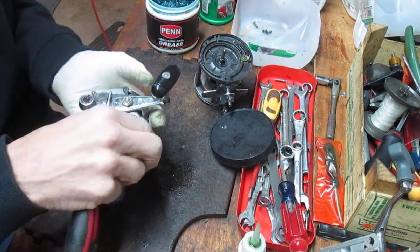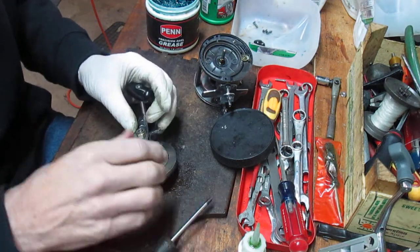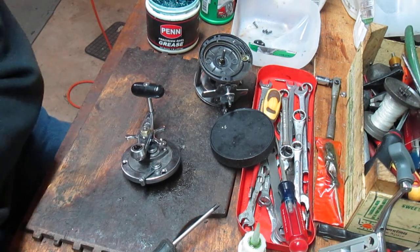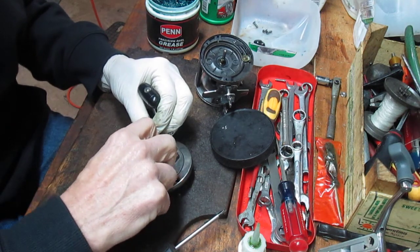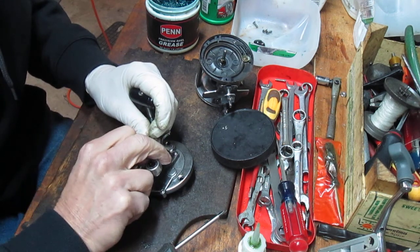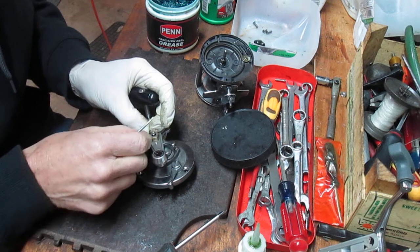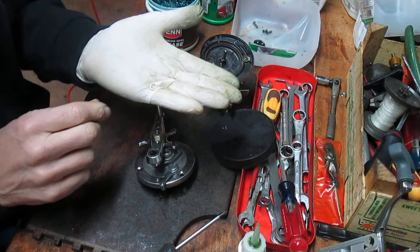It's a little plastic cap with a screw that connects into the hole here. Next up, there's an E-clip that sits in a little ridge. Some folks have the little pliers that takes that off. I don't, so I simply hold one side of the E-clip and pry it with a screwdriver until I can work it free. And there you go — that's free now. That's the E-clip.